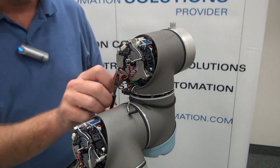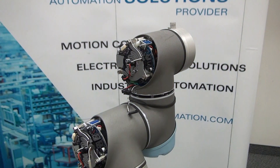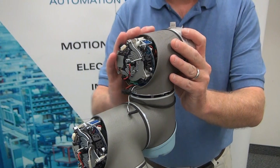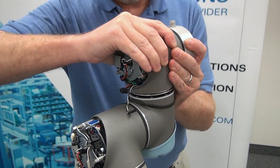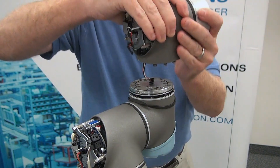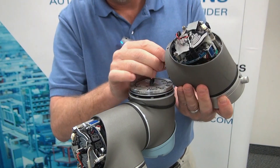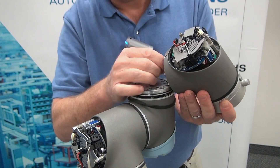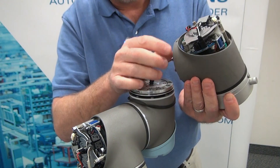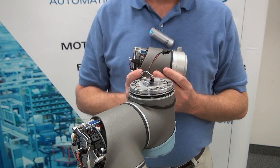You can now disconnect your ESD strap. Now that everything is loose, you can twist your joint and you should be able to lift it out of position. You'll feed your electrical connections through here. You don't need your strap anymore because the connections have been broken, so any sparks that were going to happen have already occurred. You have now successfully removed your wrist 3.